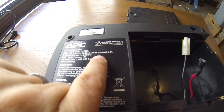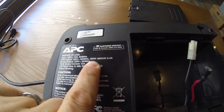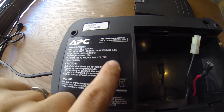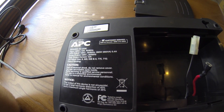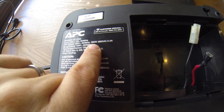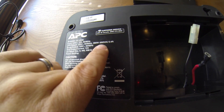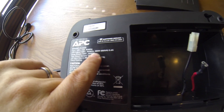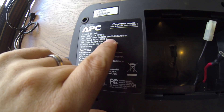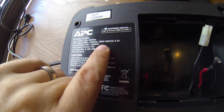Technically this is kind of funny — VA is supposed to equal watts. They're essentially the same things because the way you get watts is you multiply volts times amps, but they are doing an efficiency calculation here. Through some funky math, since this box is not 100% efficient — it's probably closer to 60% efficient — they're advertising this as a 650 VA unit when in reality it's a 400 watt unit. I think that's a little on the shady side, but at least they put both on here. A lot of other brands don't do that — APC at least puts both.